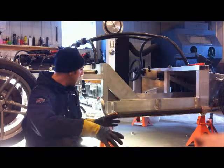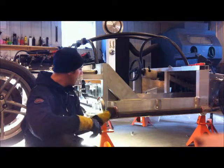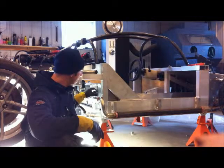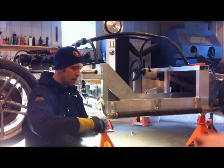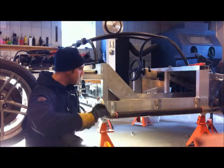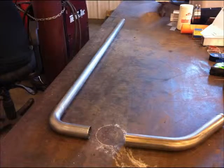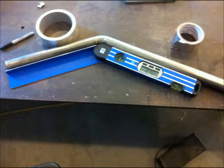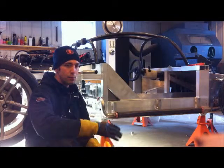I got rid of the measuring tape and all the rest of the doodads and just used the foam brackets and locked everything up in place using the brackets. So the exact distance of the standoffs and everything was calculated with what we're actually using to mount the coolant pipe to the car. Instead of worrying about detailed measurements and stuff like that. So everything was done in place as you see it, and then that was taken to a fabricating table, a nice flat work area, and then you can use a square and a level, tack everything together there. That's the best way to do it. If it fits on the jig table and everything's nice and square, when you put it on the car, everything will be perfect.